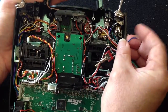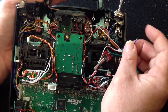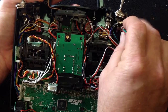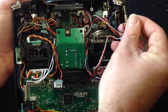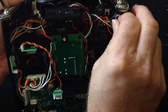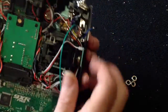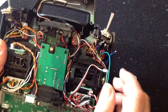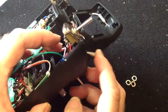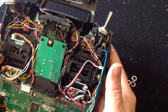You would obviously make sense to continue on because you now have a spare wire running around, and you simply have to connect that up to another switch and you've got a second three-position switch. That switch has been replaced - simple matter. For best orientation, your black wire will go towards the bottom. Position that to the bottom and then push your switch back through the hole. The next switch we're going to replace is this switch here, so I'm going to go away, take the wires off, and then pop back.